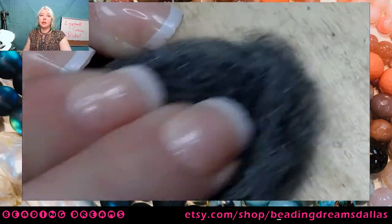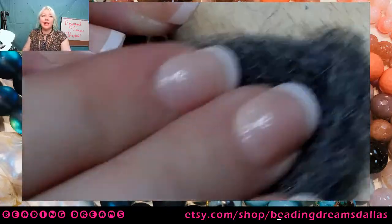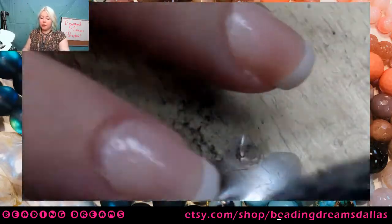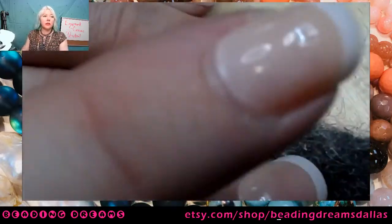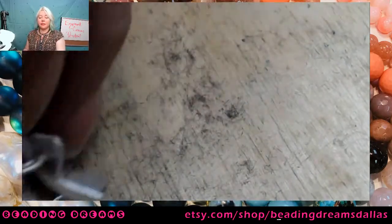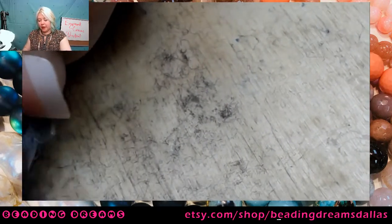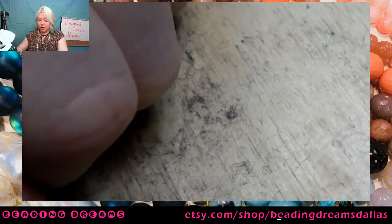Okay, so this finish that's on here is called pickle white. And it's not actually a residue. It's not something that has to be cleaned off. What pickle white actually is, is a layer of fine silver particles that are left when your pickle strips away the oxidized copper bits on your piece, and in order to make that shiny, you have to buff your fine silver to lay your molecules down, and that's what makes it shiny and pretty.